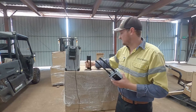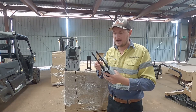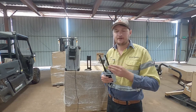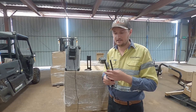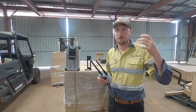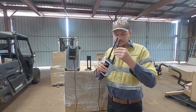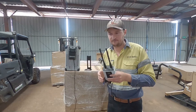They do come with a little stand as well. Some of them are mounted in — if you have the bigger antennas on top — you can mount them permanently inside a truck, car, or trailer. Get in contact with us if you need the bigger antennas. These ones are a basic antenna. Some countries are very strict with their frequency laws, so XAG brought out these smaller basic antennas. They work roughly a kilometer, which isn't huge in some circumstances. We do have the bigger antennas fixed permanently to a trailer or truck — we've worked 8K range and they're still very good. The antennas just screw off and screw on, so if you do have the fixed ones you can put these on if you want to go out and manually map a field.